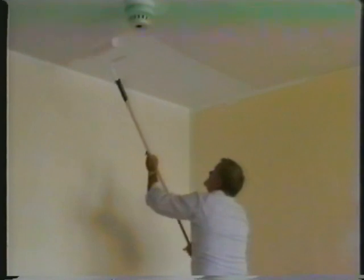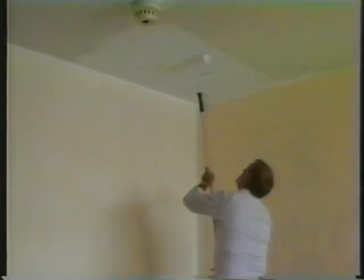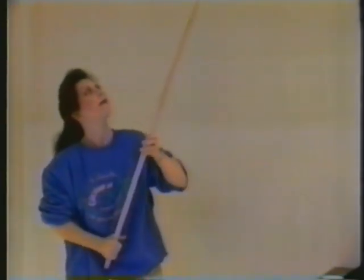avoiding uneven paint coverage. Take note also that the roller is held almost directly overhead, moving it back and forth from side to side. This allows the arms to just support the roller easily. Too much effort is required if you extend the roller out in front of you, as the inexperienced painter is prone to do. To keep lap marks from appearing from a double thickness of paint in one area, be certain to finish the whole ceiling before taking a break.